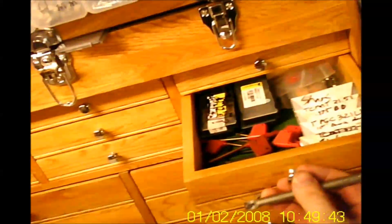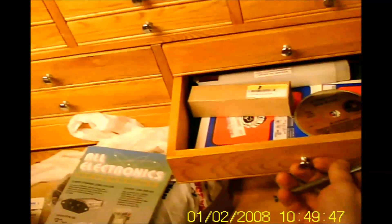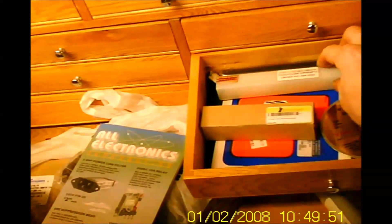I'm going to turn the inside and see what it looks like — hopefully it's good enough that I don't have to do any more to it. I'm just a little gun-shy on this one; I want to do as little as possible. That looks to be running pretty true. What do I have for boring bars? That one's way too big, so I'm going to have to go with this boring bar. The thing I'm most concerned about is this is an interrupted cut — if I snag one of these edges I'm going to either snap this bit or really tweak the crap out of this thing.